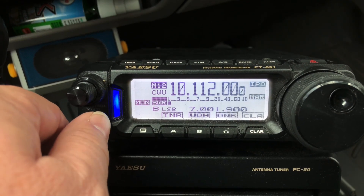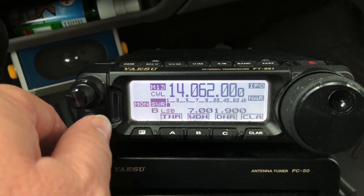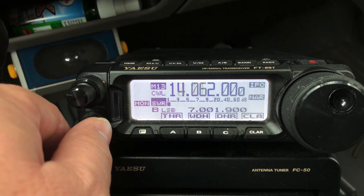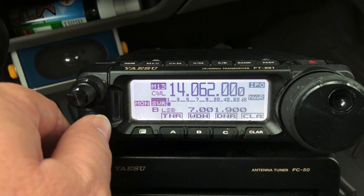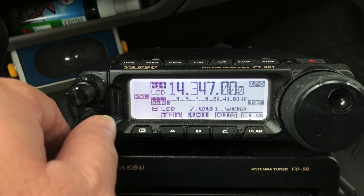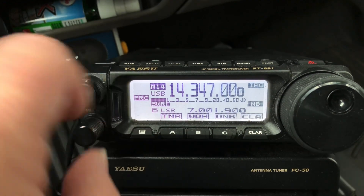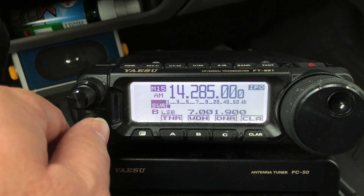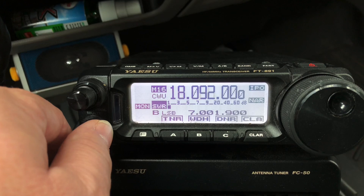Here is a popular AM frequency for 40 meters. Then there's 30 meters — I just put one in because it's all CW. 20 meters, 14.062, typical for summits on the air stations. 14.347, sideband — that's a typical frequency for SOTA stations. And then there's an AM for 20 meters.